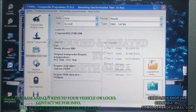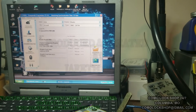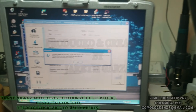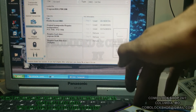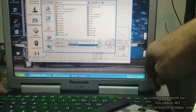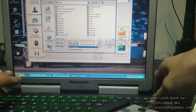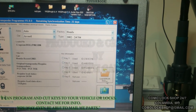The transponder is now embedded. I stick it into VVDI2 and add key 4. This key will be recognized by the vehicle's immobilizer, and it prompts us to resave the file because key 4 has been added into the binary. We save it as 'rollpin2' and load it. Now we have key 4 in the system.